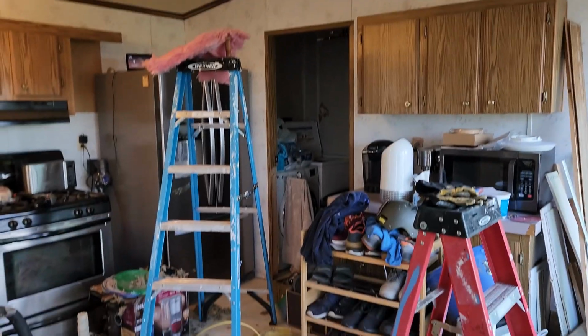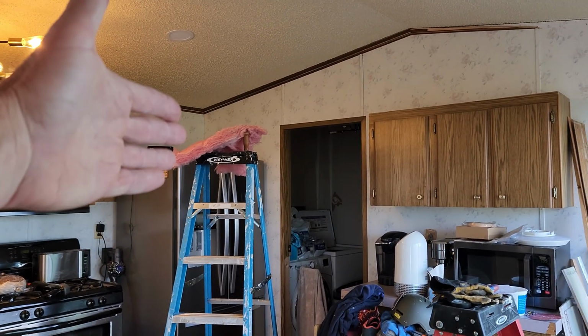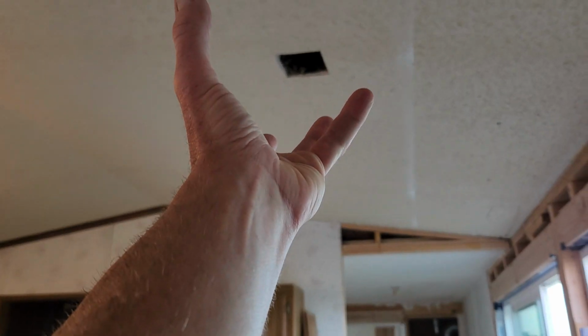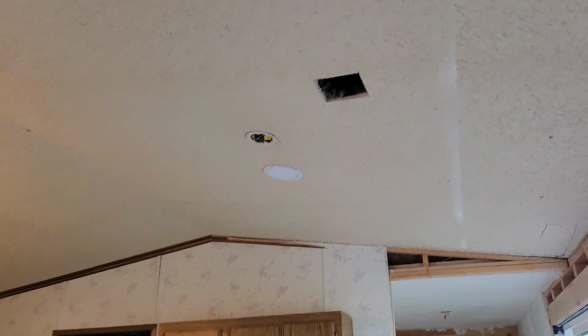And then what I do is I try to put back the blown in insulation, but if it keeps falling on you and you get frustrated, I have leftover regular wall insulation. And so what I do is I just go ahead and feed it up there in the cavity hole and then pop my lights in. It's a super simple application. Probably the hardest part of this is getting your access cuts.